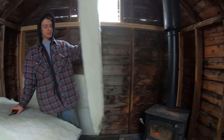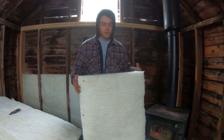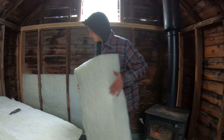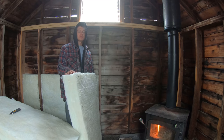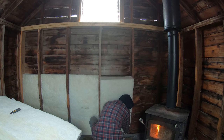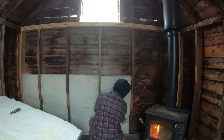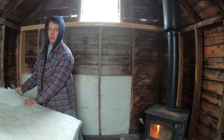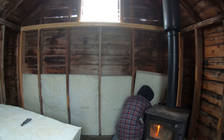This is R20 insulation for two-by-six walls with 24-inch centers, so it's 23 inches across — batt insulation, real nice to work with. Because of how I set this floor I've created a bit of an issue for how I'm going to do the vapor barrier, but we'll manage. Just get her tucked right down in there and just like that — done. It's a very easy, enjoyable kind of job.